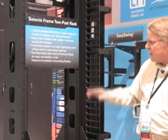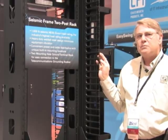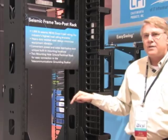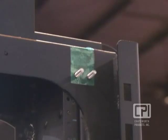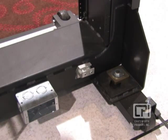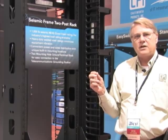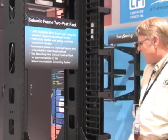The rack is fully welded construction, so it's fully bonded and grounded. On the back side, there are two studs on the bottom and two studs on the top of the rack. These studs are included in each unit, and we also include a two-terminal ground block along with a tube of antioxidant so you can attach it to the unit and ensure a good electrical connection to the seismic rack.